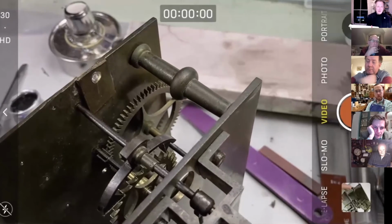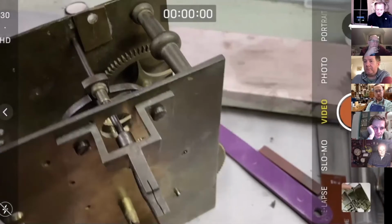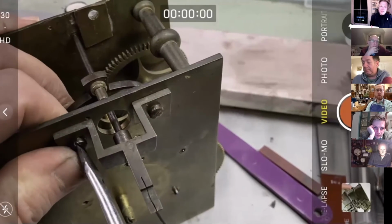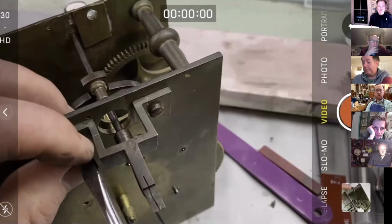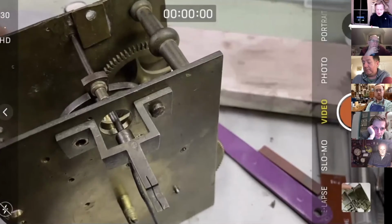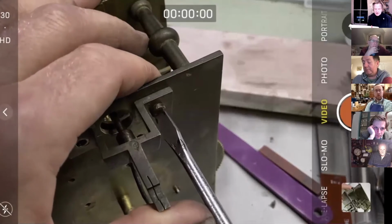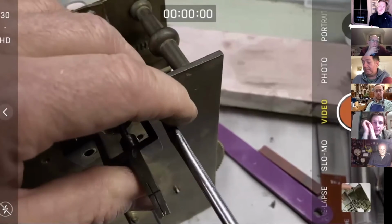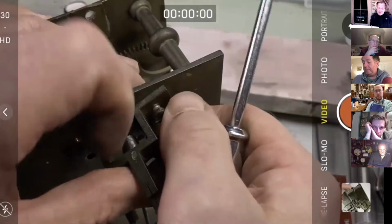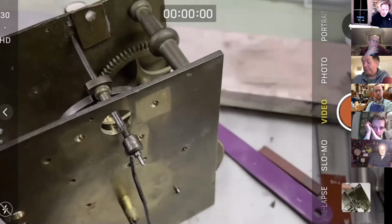The thing about drop is that you need drop. A clock doesn't work, or this kind of escapement doesn't work, if you don't have any. Now, of course, steady pins here would help things because we wouldn't have to put both these screws in each time. But anyway, we're going to take off a bit more material, and then I think we'll be there and we'll be done.